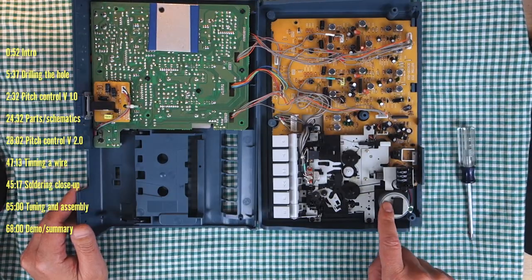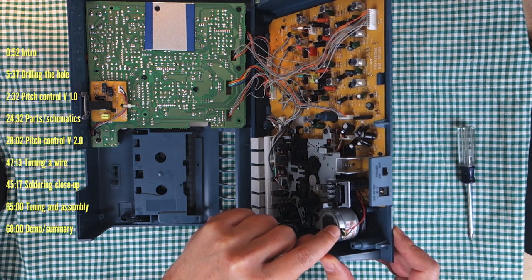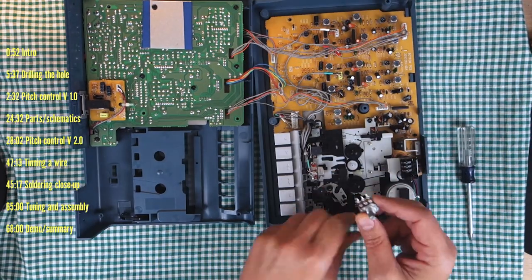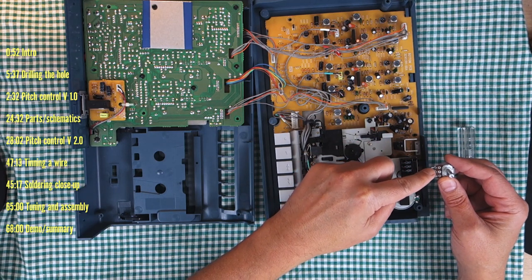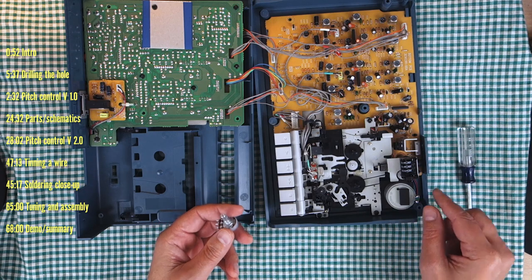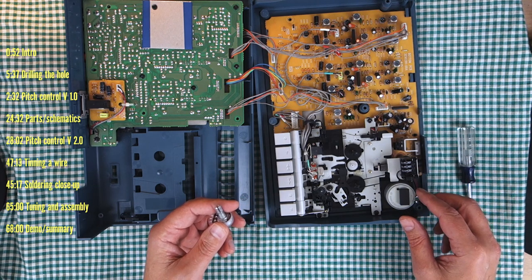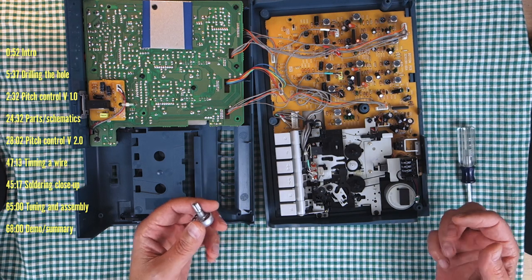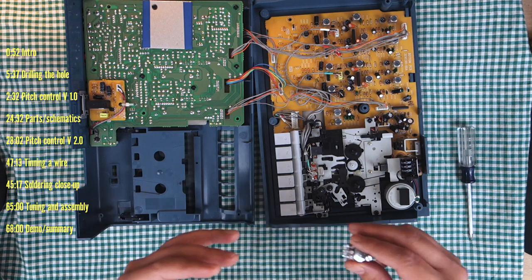The first thing we're going to do is leave the original motor inside and take the positive wire, disconnect it, and attach a potentiometer in between. Run the positive wire to one side of the potentiometer, then run another wire back to the other side of the positive input on the motor. That's going to allow the resistance of the potentiometer to change the speed of the motor. It's not really a recommended way of doing it because the motor isn't rated for that.